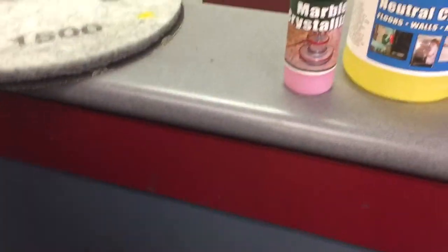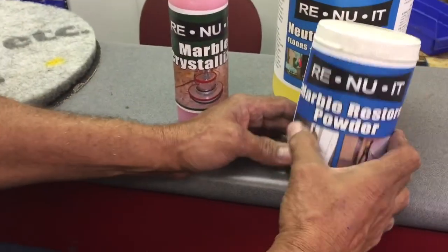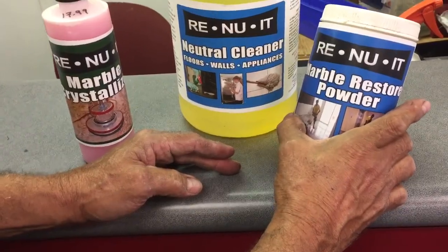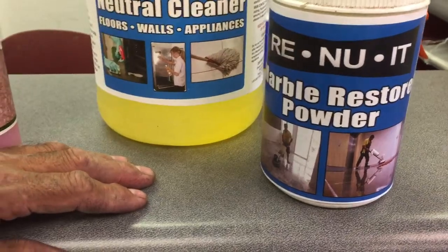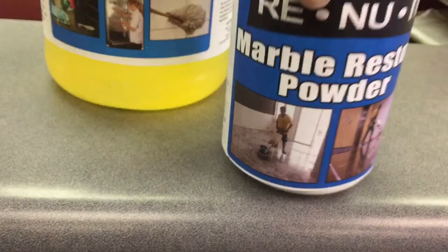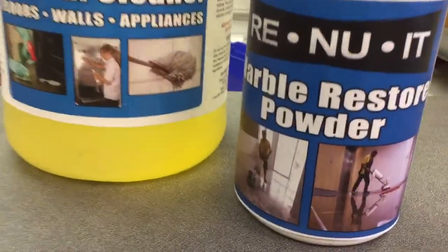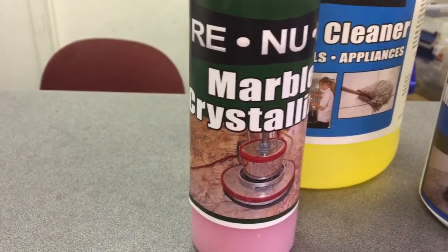Part of the other process for granite and marble polishing and crystallizing — if you have scratches on granite and marble, you use a marble restore powder. You use this with a hog's hair pad. Basically sprinkle the powder on the floor, go over it with water, and you're honing it. You can see there's a picture of somebody honing it. After you've done that, rinse the floor thoroughly, let it dry overnight, and if you want to, go over it again with a crystallizer for marble and granite using a steel wool pad to bring back some type of shine.